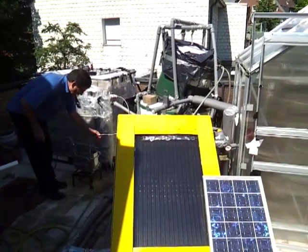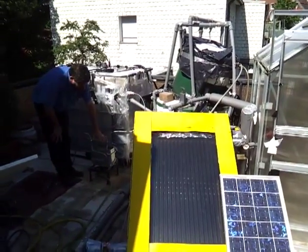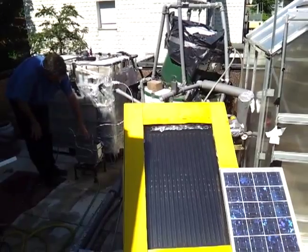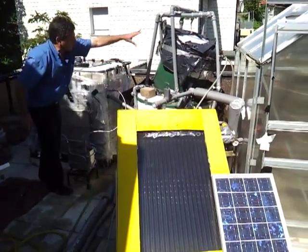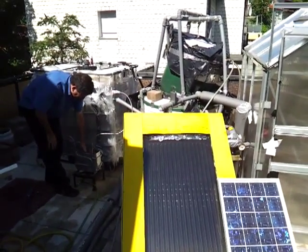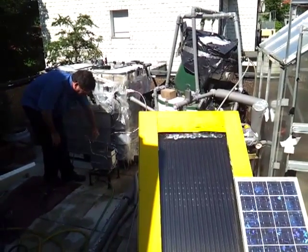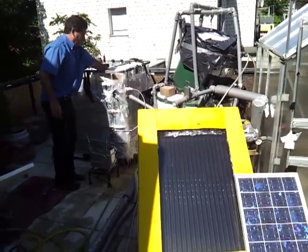But there's going to be a lot of days when there isn't enough sunlight, and that's where we have this stove here. This is the inside of a gas shower that I got from Cairo. Usually this is upside down. Here we're putting the biogas that's coming out of our gas collector through the stove. The stove is heating the heat exchanger. And then again, the cold water is also coming from the bottom of the tank and then going into an input at the top of the tank.